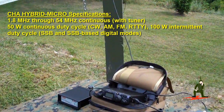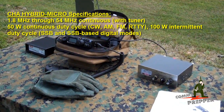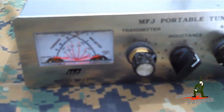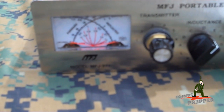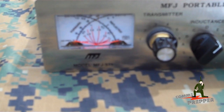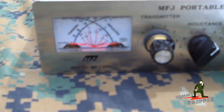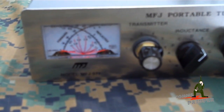We'll go ahead and fire up the HF radio and see if we can get this tuned up and send and receive some HF email. I hope you can see this with the flip camera, but we've got the radio in AM mode and it tunes up just fine — a full 5 watts out — no problems tuning this antenna. Let's spin up a Pactor frequency and see if we can send and receive some HF email.